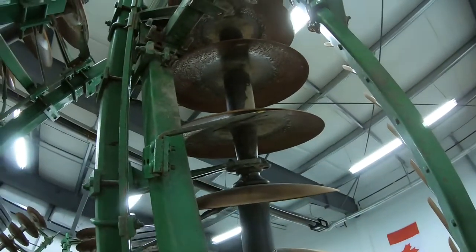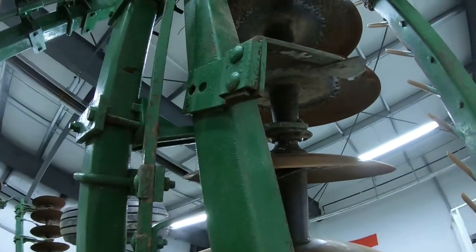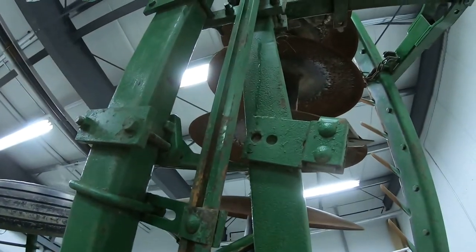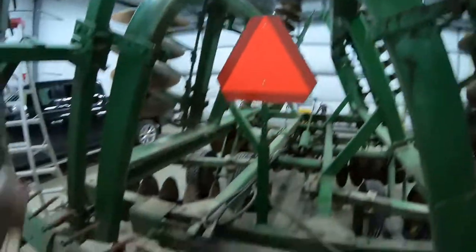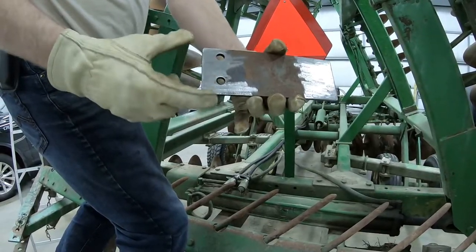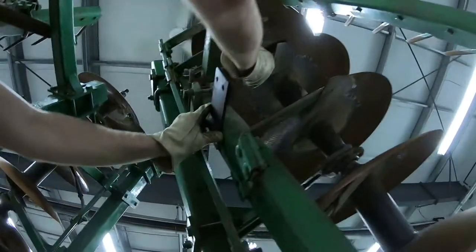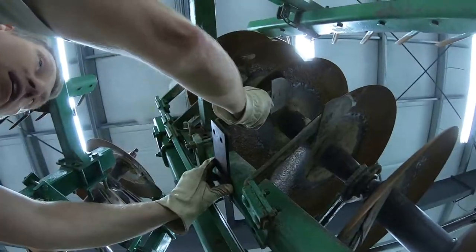We are missing a scraper up there on that disc. We have to jerry-rig another one like the previous owner did, as we cannot mount one to the mounting rail up there due to limited space and length of the scraper arm. We've fashioned this plate — three by eight inches — and drilled a couple of holes on the drill press. We're going to weld this plate up here, bolt it all together after a dry fit, and that's what we're doing today.